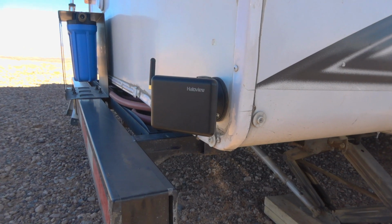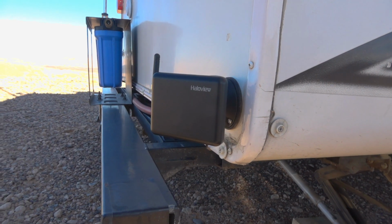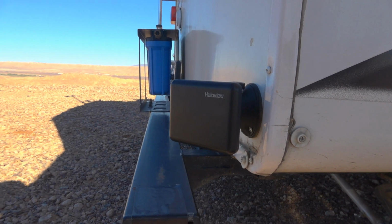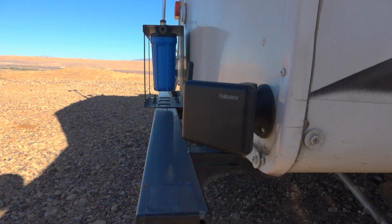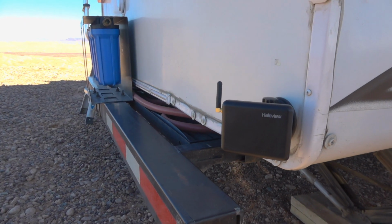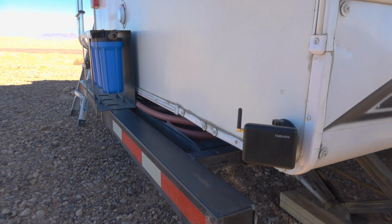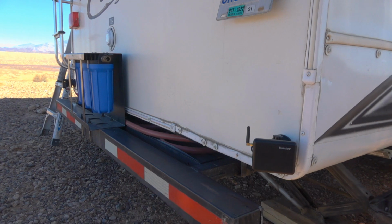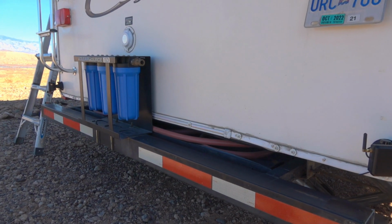By using that type of radar, it can find the speed of the target and also the range of the target. It also, instead of a dead straight shot, kind of makes a cone of radar, so it can get a 3D look at the landscape, and that really helps it deal with any other noise that might be in the environment and only concentrate on what it's looking for. The range of the radar is up to 70 meters, which is 230 feet.